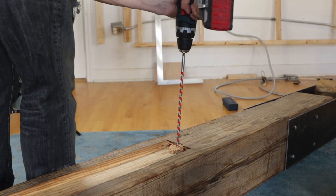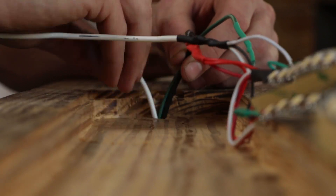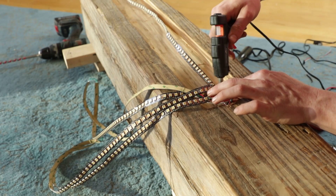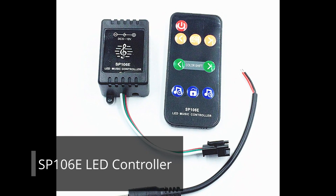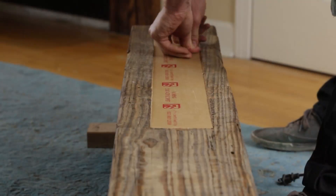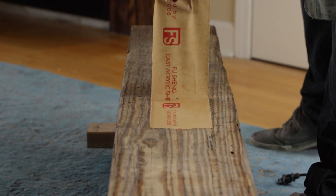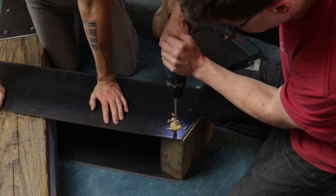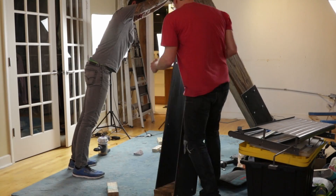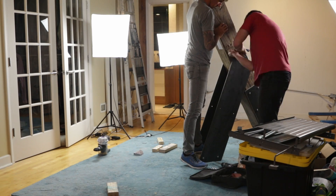I used an auger bit to drill a hole through the whole beam for the wires to run to the back, then ran the power, ground, and control wires from the SK6812 LED strips through the back and hooked them up to the off-the-shelf SP106E LED controller. This is a really cool controller — it lets you do normal colored modes including various shades of white, and it has a fun music-syncing mode as you saw at the beginning of the video. I'll put a link below; it's a pretty cool off-the-shelf controller. Maybe I'll add an Arduino later for even cooler stuff, since this is really just a big LED matrix in the lamp — leave a comment if you want to see that. The only thing left was to attach the front legs with some steel lag screws.